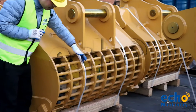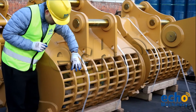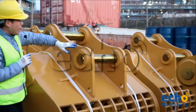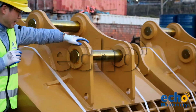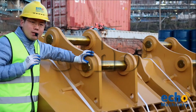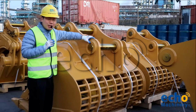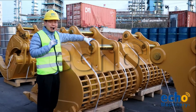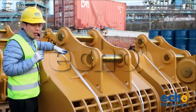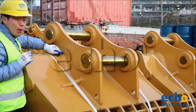Between this gap we also control the tolerance precisely, and inside you can see the welding quality is superior. The second point is here we make the precise pin, so that this pin can quickly match with your quick coupler. When your operator changes the tool, they can change it very quickly to improve working efficiency.